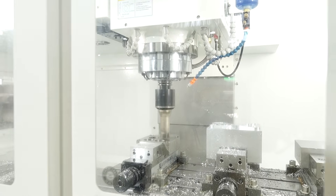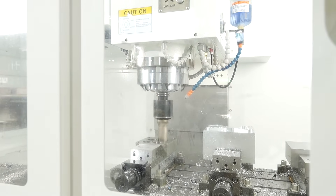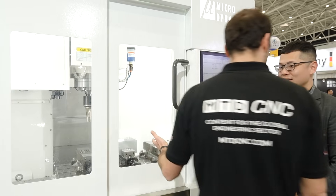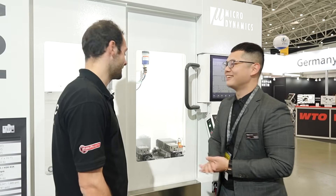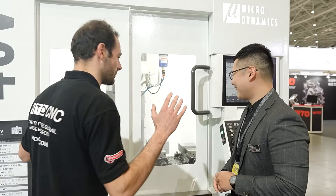You're showing a U-drilling demo right now with a BT40 tool, dry cutting — that ripped through some material really, really quickly. That's the S50C, that's the carbon steel, that's a very hard one. When you drill, it cuts like paper. That was amazing — it literally cut through without any coolant. I thought something had gone wrong. That is amazing.